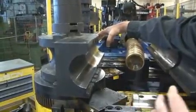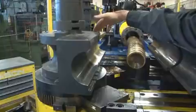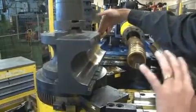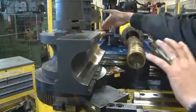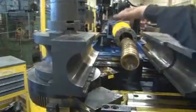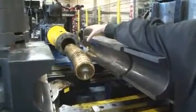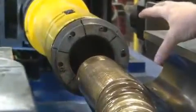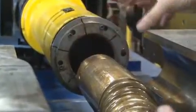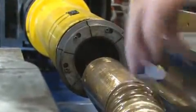Normally when you bend a piece of tube, the material gathers on the inside radius and you end up with a large lump or ripples. The wiper die actually wipes that material — that lump — away, wiping out the bump or ripples as the material gets further from the bend. The sixth piece of tooling you may need is a collet, which holds the tube. You need a collet for the tube size you're bending, and it's used when doing more than one bend on a part. It holds the tube, pushes it forward, and rotates it to the right position for the next bend.